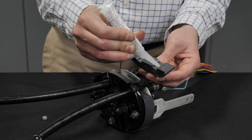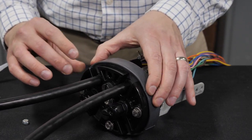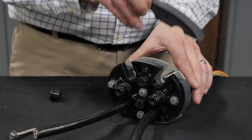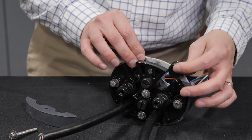Place a bead of silicone along the inside of the removed section of the elastomer. Reinstall the piece of elastomer removed earlier and loosely install the removed bolts. Remove the other unused portion of the elastomer, place a bead of RTV along the inside cut, and then install the solid plugs into the grommet holes.